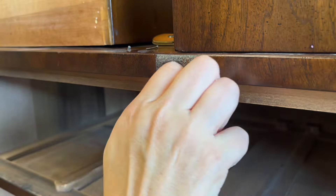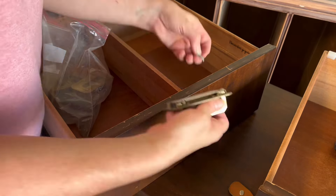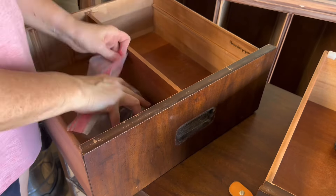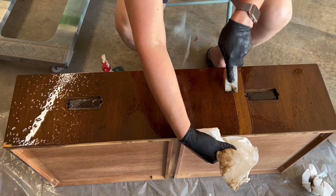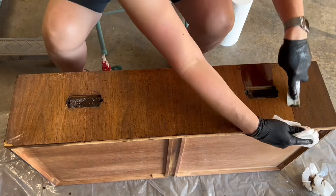So I took off all of the hardware. These were unusual because they were screwed on — usually they have pin nails — so a little bit more time to get all of those pieces off. I always like to start with taking all of the hardware off. For the top, I tried a carbide scraper to work on getting that finish off, and then I pivoted to using QCS, which is a really good non-toxic stripper, and it did a really good job.